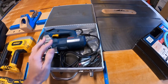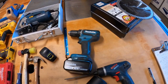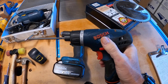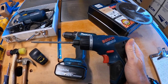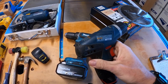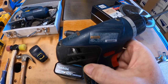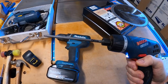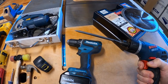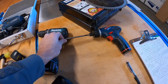The next thing is drilling holes or driving screws — you're going to need some sort of a drill. Drills come in all different shapes and sizes. The one I normally use is made by Makita. The Bosch one is nice; however, just understand the RPM isn't very high — this one only goes up to 400 RPM at full speed. That is not good for drilling holes. This is great for driving screws, but you're going to want something faster for drilling holes. If you try to drill holes with something that doesn't spin very fast, it isn't going to be effective.